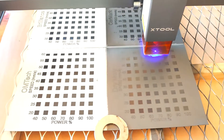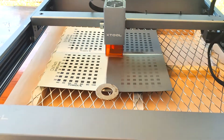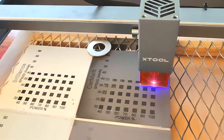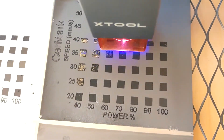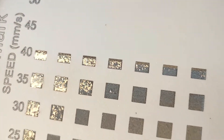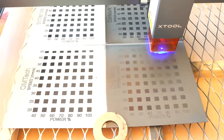I did have to put down some magnets because the metal was starting to warp, which changed the focus of the laser. Here it is so far — you can see the very top is darker, and those light spots are where the metal started to bend up and was losing focus. Here it is finishing up, and as you can see everything's been marked in its grid pattern.